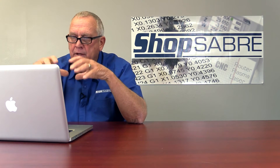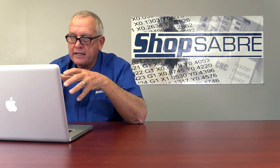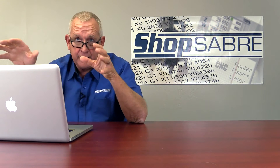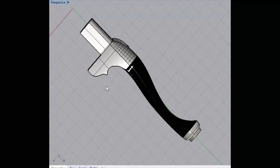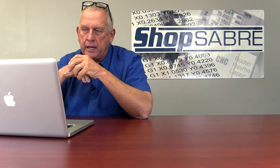I decided what made more sense was to take the geometry and create a solid model based on the geometry of the STL itself. That gives me the ability to create a group of legs that all have the same style — one for a chair, one for an end table, one for a dining table. It just made more sense to create a solid model I could then adapt to other things. What you see on the screen now is the actual 3D model created in Rhino. It's rendered right now, so it really looks nice. In a shaded view you can see it's a true 3D solid model, not meshes.